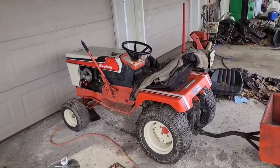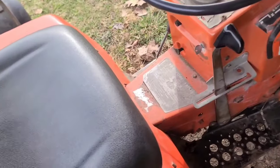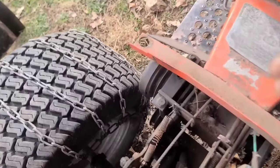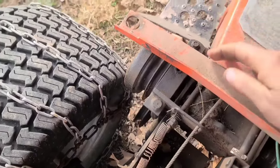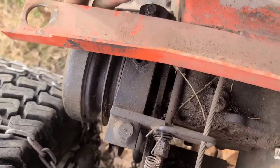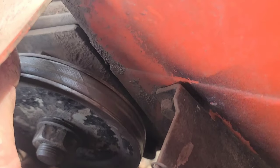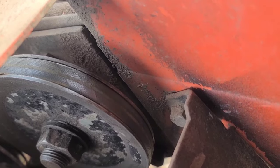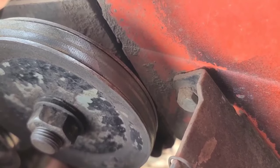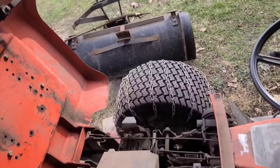I'm going to be working in between projects - I'm waiting on parts for one, so I'm going to fix something on this one. There are two issues with it, just comes with the age. I'll make sure the PTO is on. This shaft in the beveled gearbox has side-to-side play - you can see it right there, and when it's running and leans downhill it wants to bounce back and forth with the engine RPM.